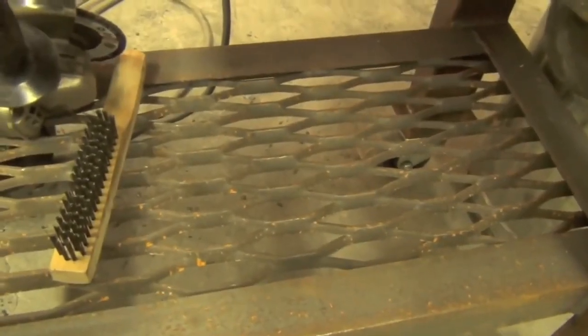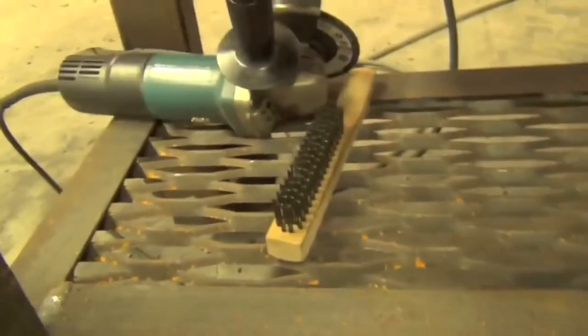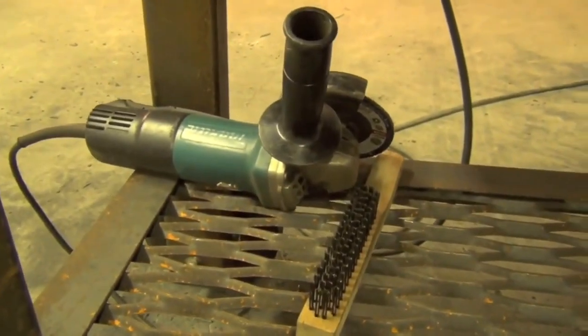Tip number 12: when building a shelf, consider using expanded metal or metal mesh. A lot of things like an angle grinder or wire brush won't fall through, but bits of slag and dust go straight through — that's the main advantage. The main disadvantage is that smaller items like silver pencils, Sharpies, and MIG tips also go straight through, so this isn't a one-size-fits-all rule, but it's something worth considering.